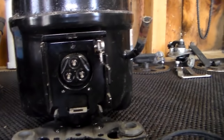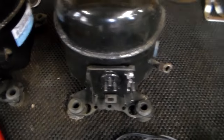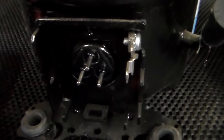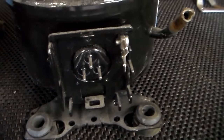But for testing purposes, we're just going to use a standard compressor that's on most every refrigerator, especially older ones, and take an ohm reading on these three little terminals right here. Let me get my camera set up and I will show you what kind of readings you're going to get and which ones to test.